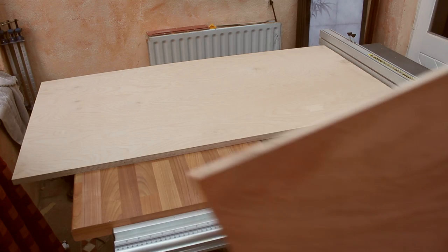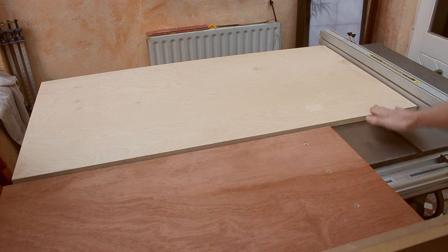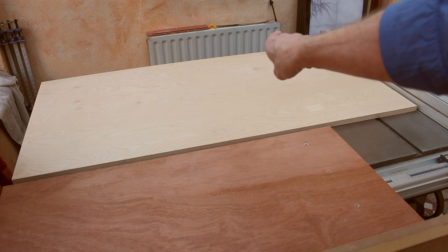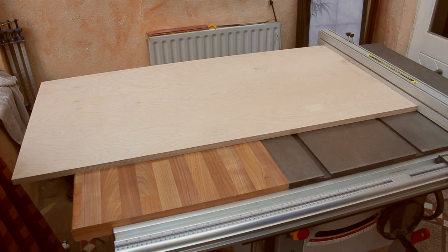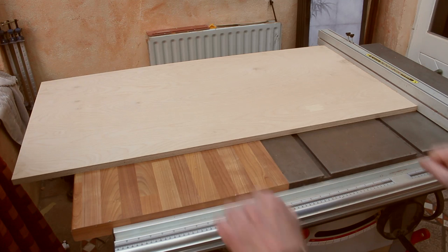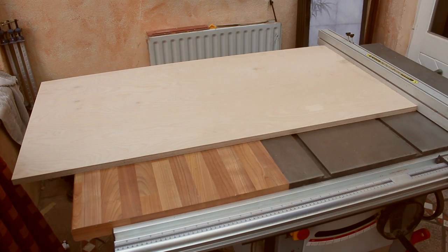I do have a half sled for large pieces, but half the workpiece is overhanging, and when the blade gets to the end there's a risk of breakage. I don't have any excess in this piece of wood — I really need all of it bar about a couple of millimetres. Even if I put the half sled in with something underneath to prevent breakouts, I'd still want the rip fence, and you mustn't push on a sled whilst also using the rip fence — that risks the workpiece yawing around and grabbing the blade.